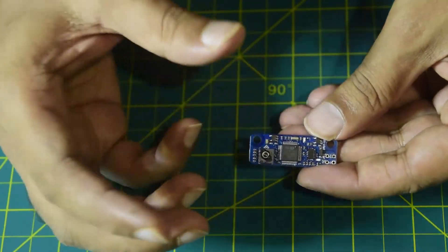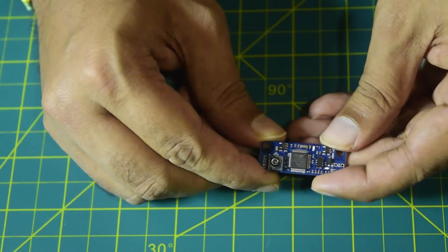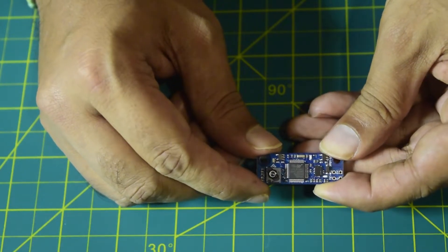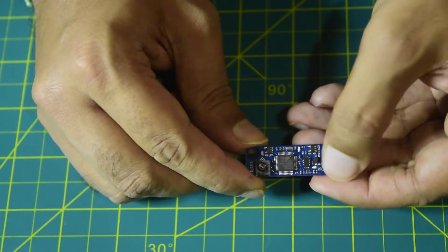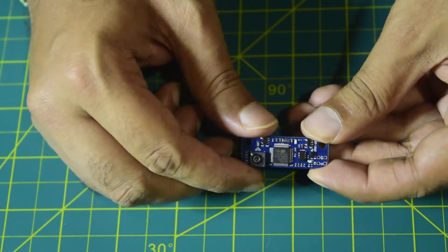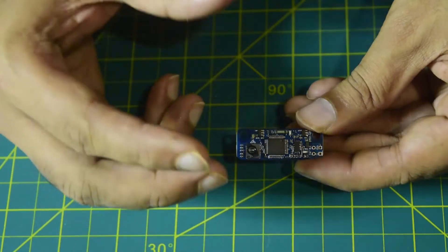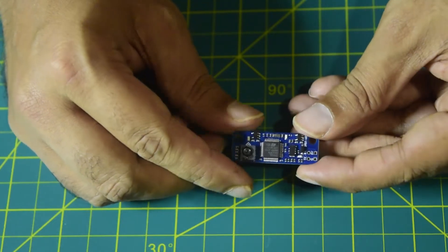This optical flow sensor works very similarly to your optical mouse — whenever you move your mouse it senses the movement and direction. In the same principle, whenever your drone is moving front or back, the optical flow sensor will detect the motion and correct the position of your drone to keep it in one place. The LiDAR sensor gives you the height reading to ensure your drone stays at a given height. So this helps you hold both position and altitude without the use of GPS, making it very useful for indoor drones requiring altitude hold and position hold functionality.